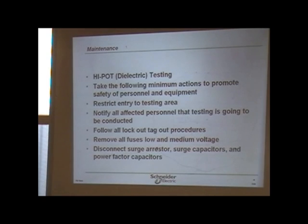The process is the same for every piece of equipment, like I was telling you. It makes no difference; the process is the same when you go troubleshooting. You're not going to close this without all this stuff being open, because that's going to be under load. And the minute you put it under load, what if one of these down over here has a short in it, and you close these, and then that short's going to come right there, that's where the short's actually at now. The fault is waiting for that potential.